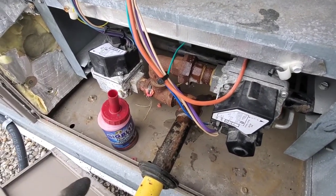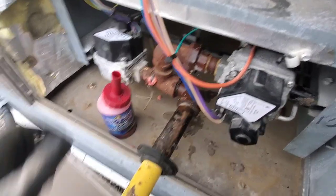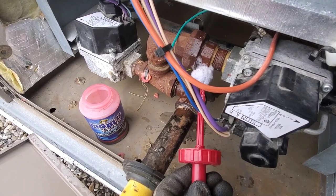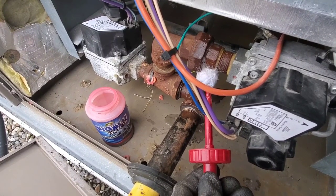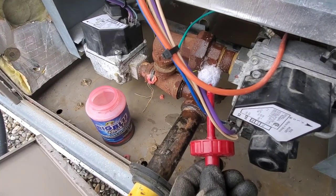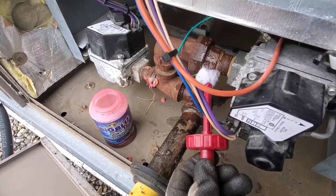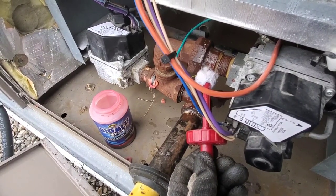After my repair, I noticed there was a smell of gas — quite strong actually. I grabbed the Dauber bottle, and going to this union right here, we can see it — it's a pretty big leak. The Dauber is good because you can hold it right against where the leak is and it shows itself. Sometimes if you just coat it with soap and it's a big leak, it doesn't really show up, but as soon as you hold the Dauber against it, you can see it bubbling through.